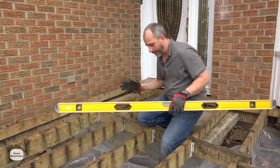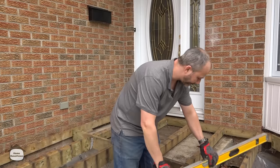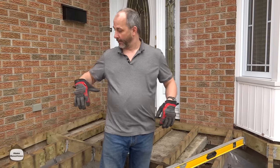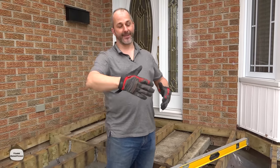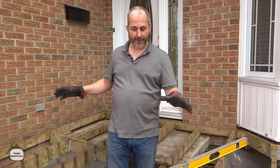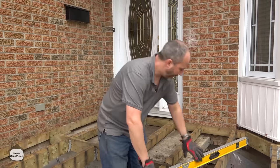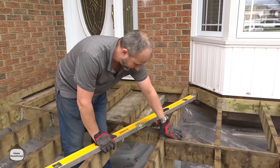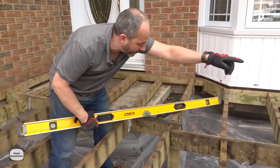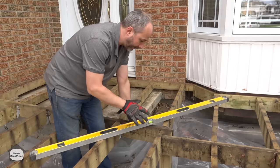What we can do is come up with a strategy for restoring this frame so we can put a deck surface back on top. The homeowner did get one thing right: joists on a 16-inch center. We're not too concerned about it being out of square. To save your deck structure, you want to find out where all the load is. Since all points in this deck meet up in the middle onto one post, it's carrying the majority of the weight — every step taken transfers load across these beams to that one point, pushing it into the dirt.